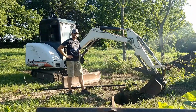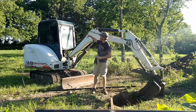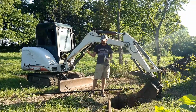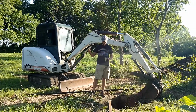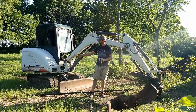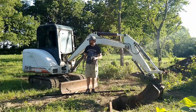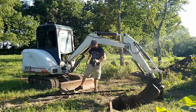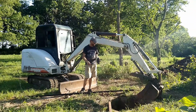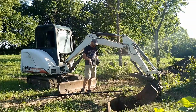We got about 30 feet of pipe up, and of course it's way in the air, and it's leaning right towards me. I have this nice glass enclosure, and I'm thinking I should probably push the pipe off to the side a little bit so I can bend it like it's bent all the other times. So when I did that, it just snapped in half, and the last link fell down in the well, and the rest of it just fell that way. This link was 18 feet, that next one was 10, then we had some smaller pieces, there was 28, a 4 foot piece, a 1 foot piece, and it stuck out the top maybe 2 feet, so we figured we're down at least 30 feet. We ran the camera down, we were 40 feet, so that last link was probably only a 10 foot link, like the beginning one was. But anyway, it's just down at the bottom of the well now.